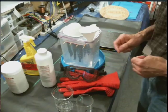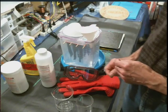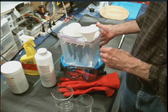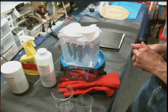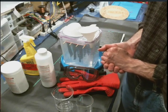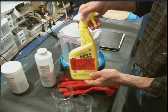I've already prepared this last night and it's been sitting here for about 24 hours. I'm going to go through the steps so you know exactly how I got to where I am, and then after I'm finished I'm going to show you how I do the spraying. The spraying process helps build more layers. After the first caustic steam you're welcome to repeat it as many times as you wish, or you can also do the spraying — spray the plates and coils with the caustic to help build the layers. I've prepared a little bottle here of the solution.